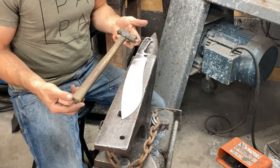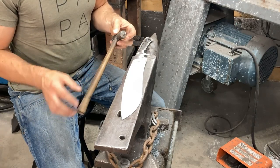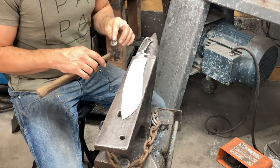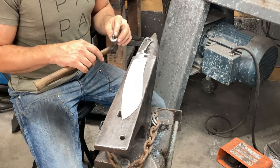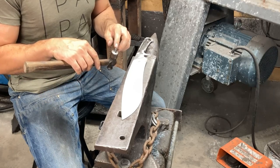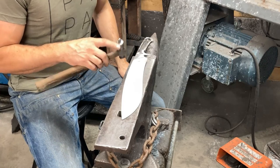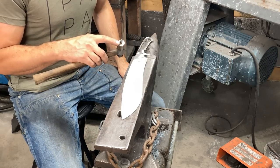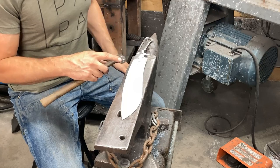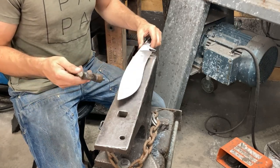This is a little 8-ounce ball peen, and it has a broken end mill with a little cross peen face ground on it. This is a carbide end mill with a tiny little cross peen or straight peen face ground on it, jammed into a bored hole on the end of this hammer to make a quickie carbide planishing hammer. I'm going to planish straighten, so I'm going to do this sort of a thing.